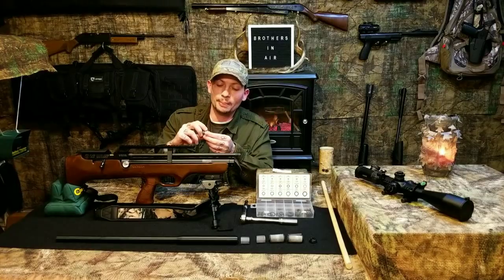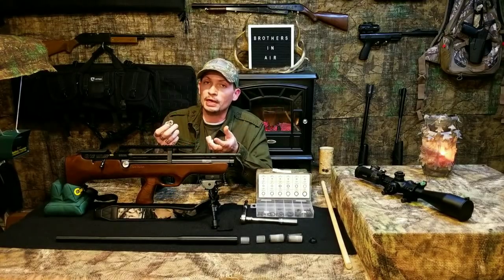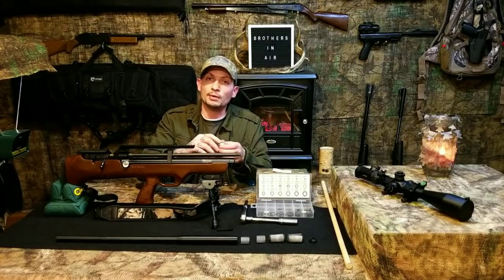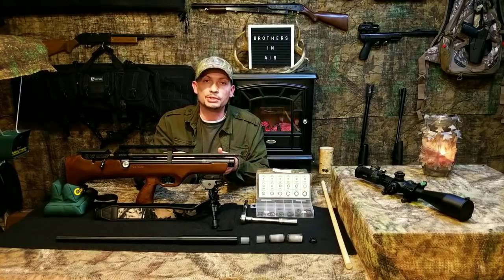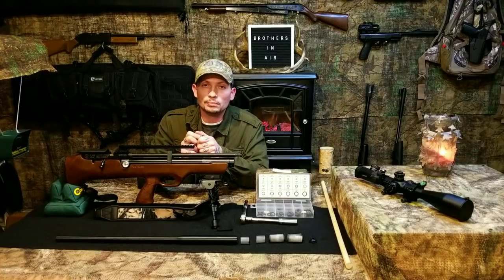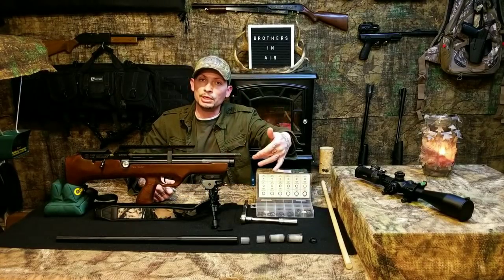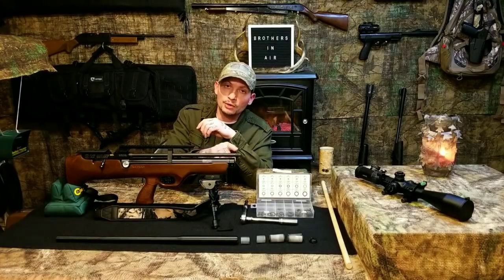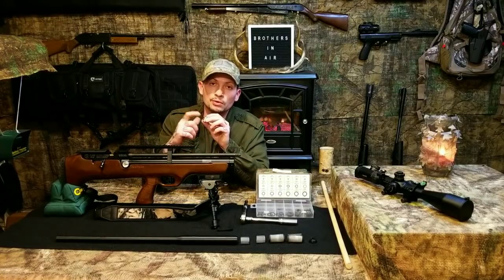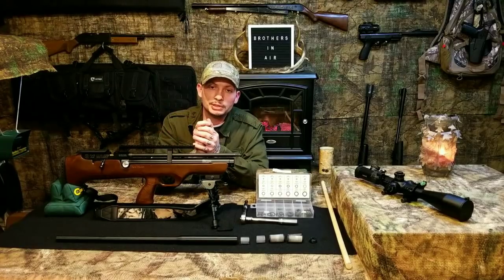The A-114 fits tighter in the shroud and seats tighter into this groove. Once I installed this O-ring and put the shroud back together, I only needed that 14mm socket to snug it up to where I wanted it initially, and from that point on I've taken the shroud off 20 times and the nut doesn't slip or spin. The shroud comes up right where it should, with the QE on the side and that milled flat on the bottom lined up just right.